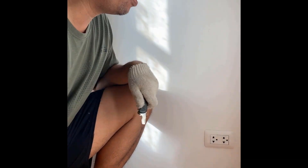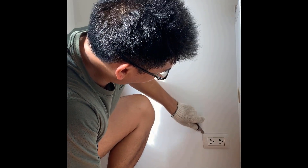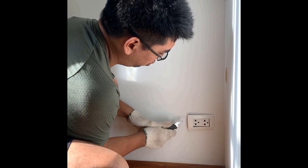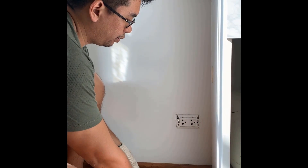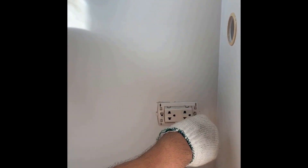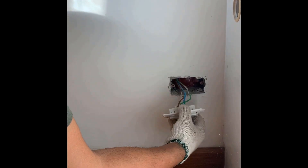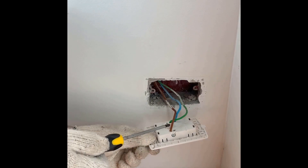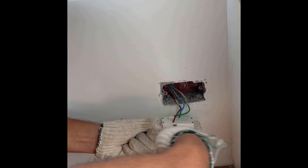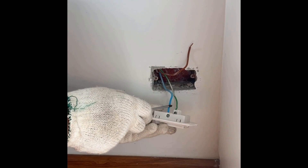Now I'm going to remove the mask using a flat head screwdriver. That came off nicely. Now I'm going to use a Phillips head screwdriver to remove the screw. Then I'll remove the screw to release the live wire from the receptacle. You also want to put on your gloves to insulate yourself from the wire. Then loosen the screw to release the neutral wire as well.